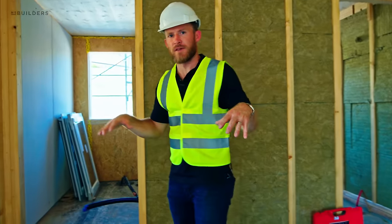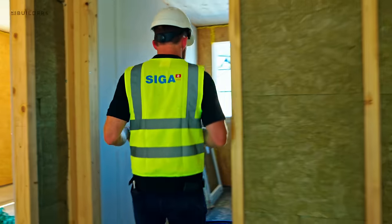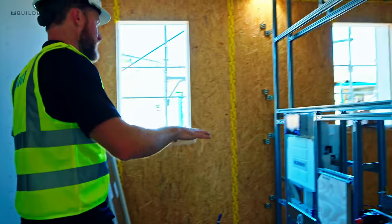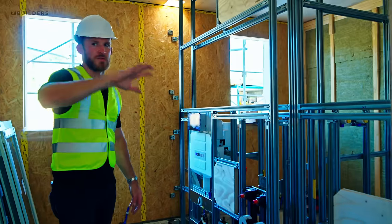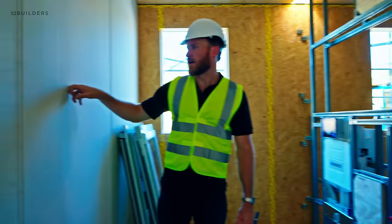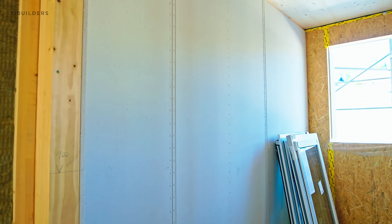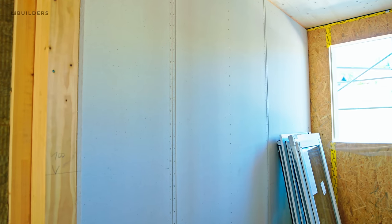This is the lower level, and you have a lot more of the interior walls. This is the first time I'm seeing this. Before I even address this, you see a lot more of the cement-based gypsum. This right here is obviously prep for tape. So they manufacture the gyp a lot differently here. Again, they're stapling it instead of screwing it. All of the staples seem to be on the exact same angle, because they're installed in a factory. So again, you're saving on the labor. This stuff is built as panels.